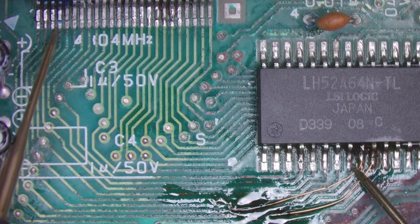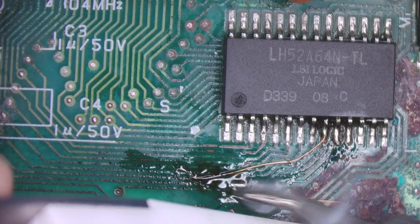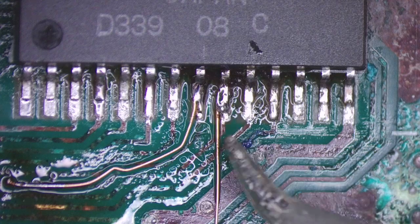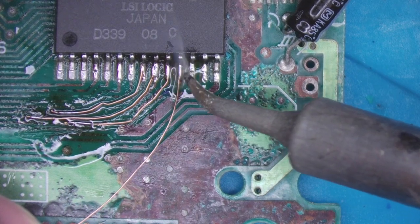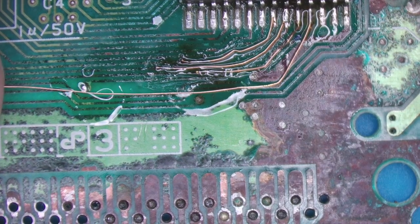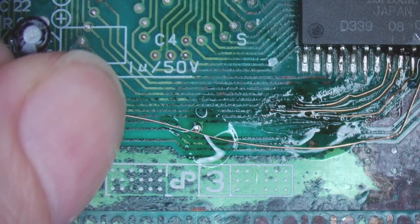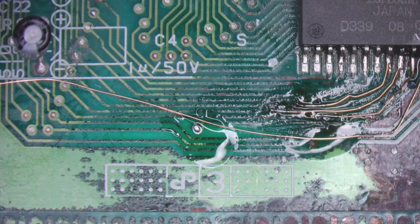This one should go up to here. I've made that too short so I'm going to take them both off and give myself a bit more space to play with. It's voiceover time — this is where I go wrong. I attach the jumper wire to this wire, but when I refit the game slot and work on the same wire on the other side of the board, this original jumper falls off and I can't reattach it because it is now covered by the game slot.